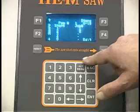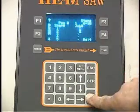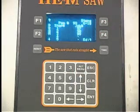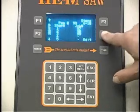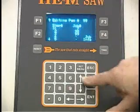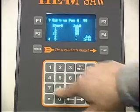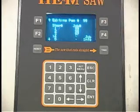The program data for program 99 shows that it has jobs 97, 98, and 99 already programmed into it. If you want to run them in a different sequence — for instance, press edit and say job 1 is 99, then 98 — you can tell it to run the jobs backwards, so it goes 99, 98, 97. Just that easy.